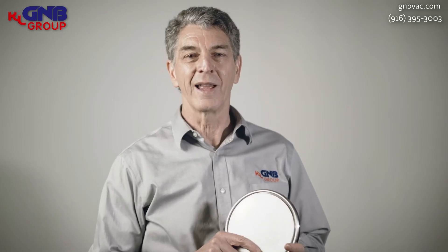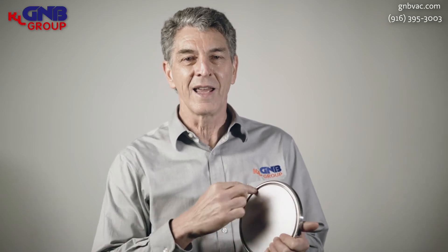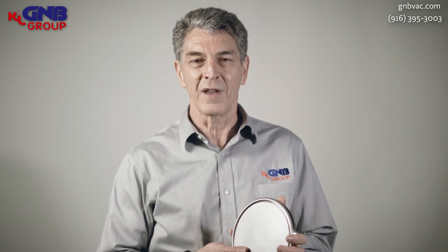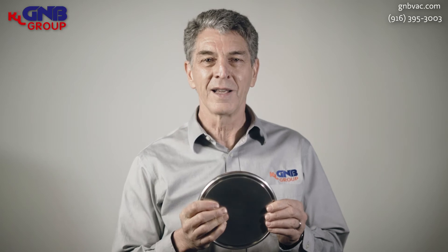Here I'm holding a vacuum flange. This particular vacuum flange has an o-ring groove that is cut into the vacuum flange, and the o-ring is pressed into this groove and it needs to seal. In order to make that seal you need a very special surface finish. In some cases the part is round and you can cut that on the lathe, so you get a nice concentric lay of the surface finish at the bottom of the o-ring groove.